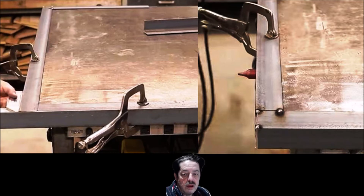Let's look over on the right. You can see he tack welds just like I do — just like I'm explaining you need to do to keep this thing square, straight, and looking good. He puts them in all the corners and lets it cool down some. It doesn't have to cool off totally. Then you might want to put a little one in the middle of each of these tack welds, let it cool a bit, and then run your beads. This is giving you a visual on exactly how to do this. It will come out perfect if you've squared the inside, squared the outside, and done exactly what I'm saying.